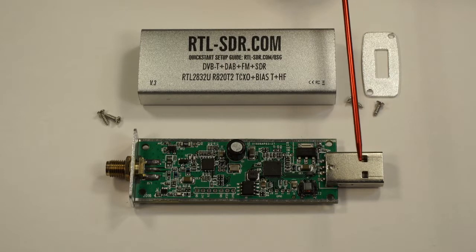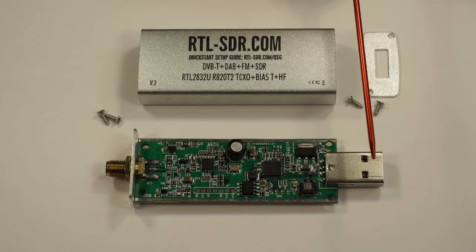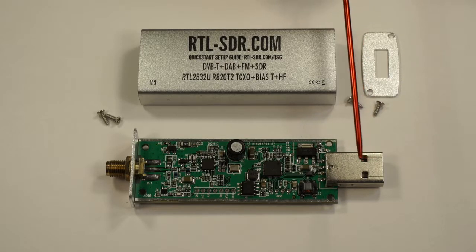Those stream off to the computer, and it's the computer's job to utilize that data to show RF spectrum and decode modulation like FM, AM, upper sideband, CW, and et cetera.